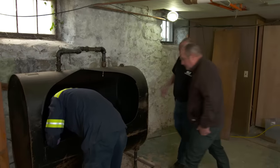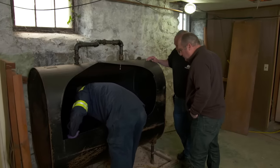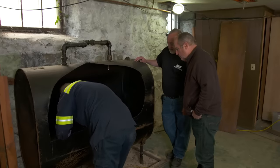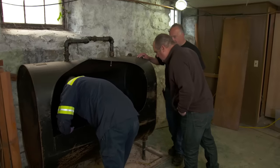How much sludge do we have? Not too bad — looks like 15 gallons or so. Normal for this aged tank. What are we doing now? We're scraping it down and then we're going to start scooping it out into those five-gallon buckets. Then we'll take those five-gallon buckets and put them into the drum out in the truck. After it's all cleaned out and wiped out, just carry it right out.